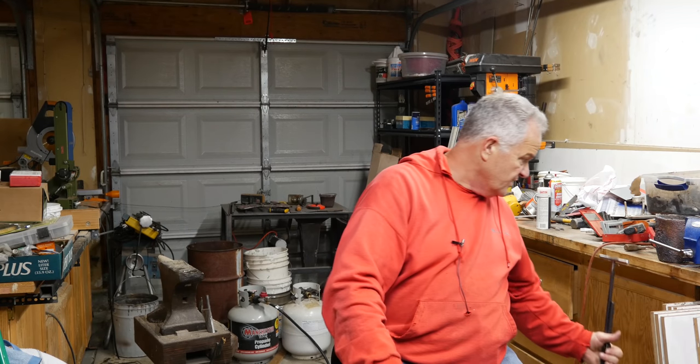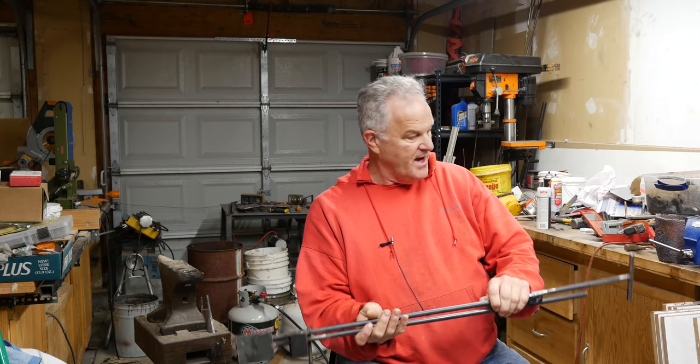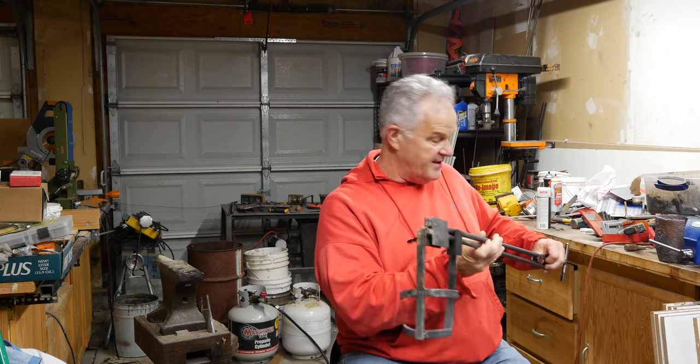That's how mine works, and I'm going to show you a real pour. But here's why I did what I did. First of all, I know me. I know that if I had to pull that crucible out of the furnace, set it down on something, and then pick it up again with something on the outside, there is a distinct possibility I'm either going to drop it or knock it over — and I know that's what happens, accidents happen like that. I wanted to minimize the possibility of an accident. So that's why I built this. This mechanism allows me to go down inside the furnace, clamp onto the crucible, take it out, pour it, put it back in the furnace, release it, and get out of there — all one thing. I don't have to set the thing down. I don't have any intermediate steps.